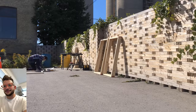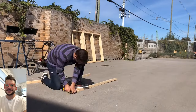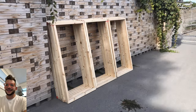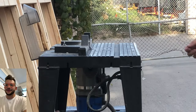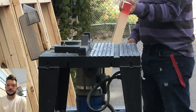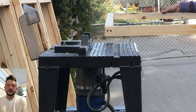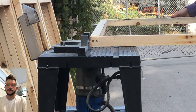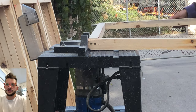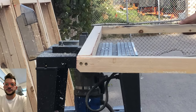We're driving two three-inch construction screws into each corner and doing that for all 24 frames. You'll see me sighting down the boards to make sure there are no warps, weird knots, or anything in the wood. Here's a time-lapse of building all 24 frames — it was a nice day so it was great to work outside. Here's the router with the 45-degree chamfer bit, and once I start pushing this frame through you'll see the profile it leaves on the frame.